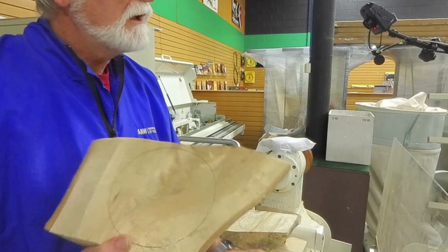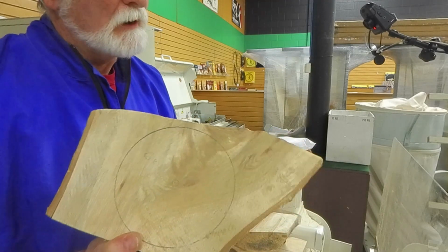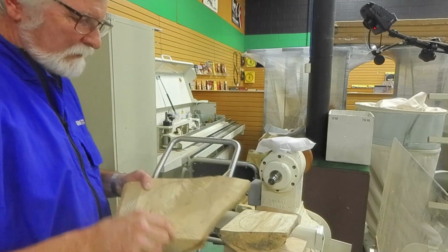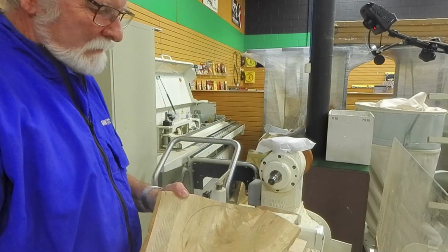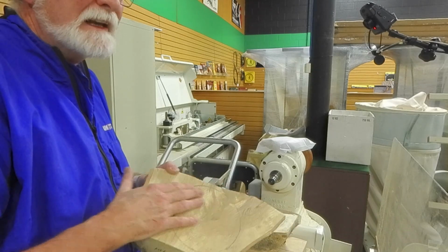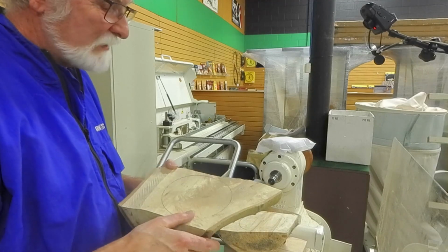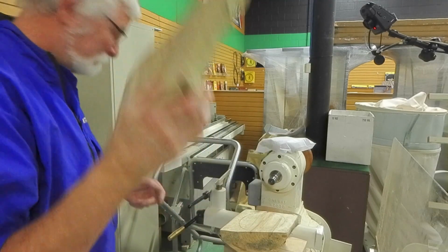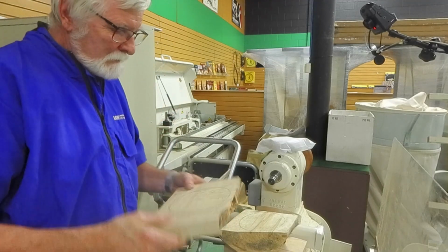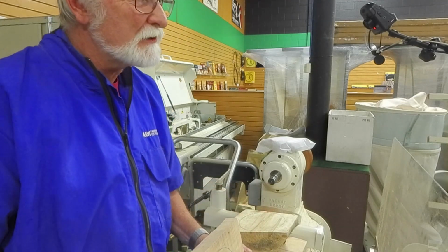By the way, I'm not taking any of these crotches home tonight. So if somebody wants one, come get it. This, you think, oh, aspen poplar, yeah, boring. A little bit of Danish oil type stain, wipe on poly, brings this out, it's spectacular. Poplar. It's easy to turn too. So I want something that's about 6 inch. So this piece is 6 inch.